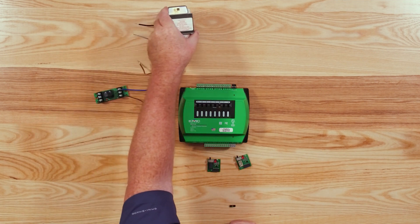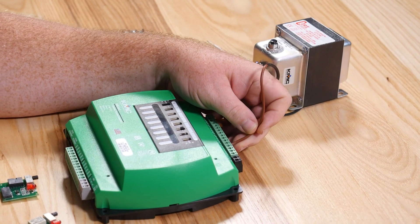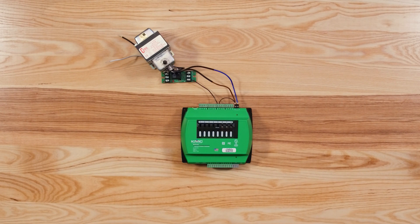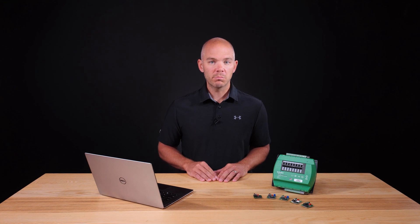When wiring the 6701 triac board, you will need to supply 24 volts AC to the switch common terminal. If this board does not receive 24 volts, it will not function properly. There are two ways to do this. First, if the output device requires its own transformer, power the switch common port using that transformer — having everything for a given output on the same transformer is standard and best practice. The second option is to daisy chain power from the controller's phased power terminal, but only if the output does not require its own transformer and the transformer has the VA capacity to power both at no more than 80 percent capacity.